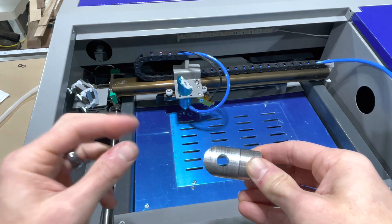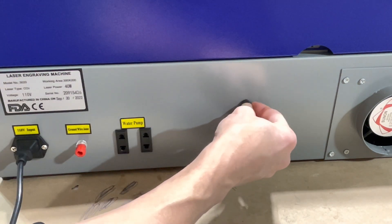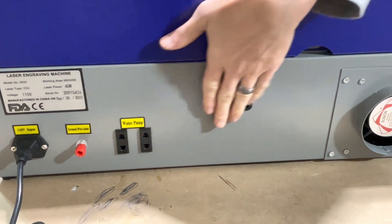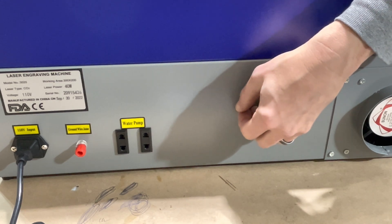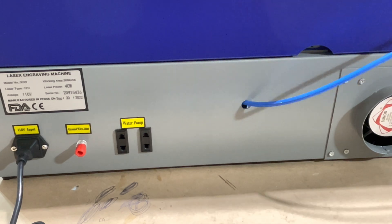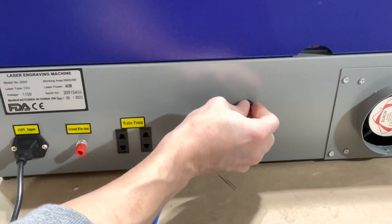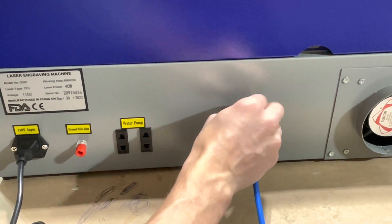This next step isn't necessary, but on this machine there are a lot of available holes. I've taken little rubber grommets and fit them in all the holes around the machine — some just to cover them up, some where cabling will feed through. In this instance, this is where our air assist tubing will come out. This makes it look nice, but it also prevents sharp edges from cutting into cords and prevents dust and contamination from creeping into the machine through those openings.